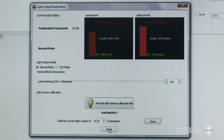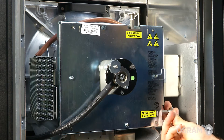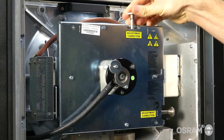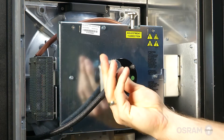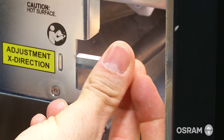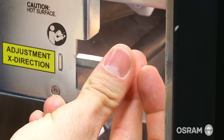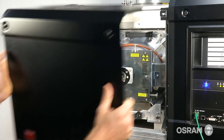The window on the communicator touch panel shows the measured value of the projector's built-in light sensor in the upper left corner. Adjust the X axis, the Y axis and the Z axis for maximum current light output. Carefully turn the thumb screw for maximum light output. Once over the maximum, turn slightly in the opposite direction to reach the maximum light output again. Do this for each direction and repeat this adjustment cycle twice.